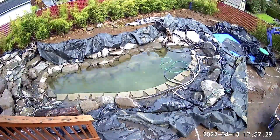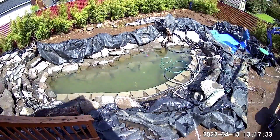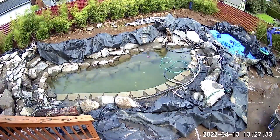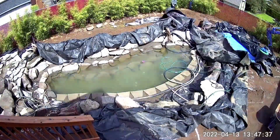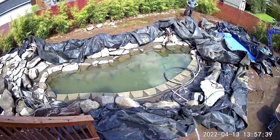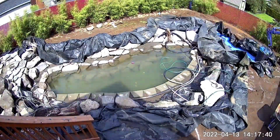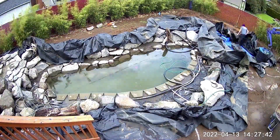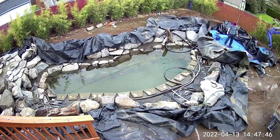In this video, I'm cleaning up the excavation around the top of the cistern and shooting elevations again to make sure I have the milk crates I need to do a fourth layer in the cistern and confirm that the elevations still work, which they do. That means my cistern will now be almost 2,700 gallons instead of just 2,000, and that'll be a big help in the summertime.